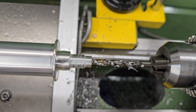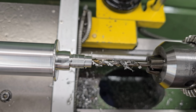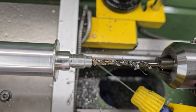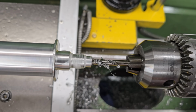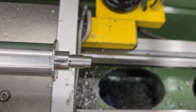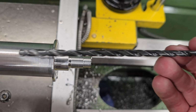to follow. So we're using our standard length drill to drill around 40mm deep, and then we can come through with our extra long 5mm drill bit and go the rest of the way. The pilot drill just helps keep the long drill on center and starts it off with a nice guide hole. And as you can see here, what we're doing is just taking nice shallow pecks with our long drill, clearing out the chips and then adding some WD-40 and then taking another small peck.